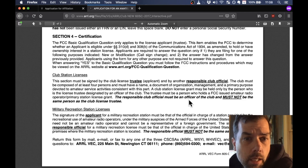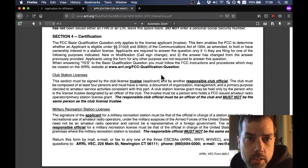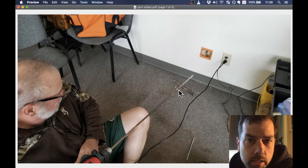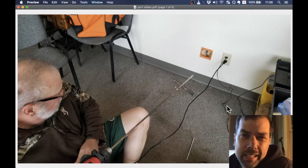What I've got next is a slideshow of us finishing up the through-the-wall antenna port. I wanted to take some quick pictures — there wasn't much video since it was just drill noises and banging hammers. Here's a picture of a rod drilling through the wall. You can see a cold chisel we used to break up some masonry with a big hammer, and then we picked out a piece of rebar. It's just concrete, brick, stucco — we took the rebar, shoved it into a hammer drill, and pushed it through the hole we made on the inside to locate on the outside where it went. We were pretty lucky that we didn't hit any concrete joints or any wiring.